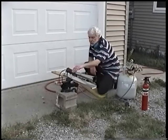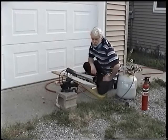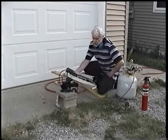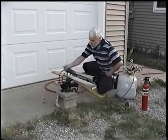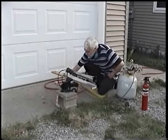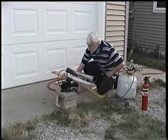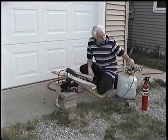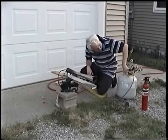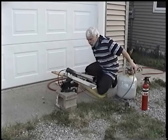The front end here, the chamber, is dark and discolored just because of the final welding that was done. I asked them not to polish it up since I was intending to run it right away, which would mess it up again. We've got propane vapor for fuel. The high voltage connections are here for the spark plug, and the starting air is just the usual blow gun here. I've got propane set up to about 12 psi.